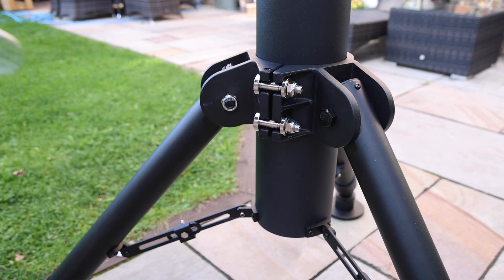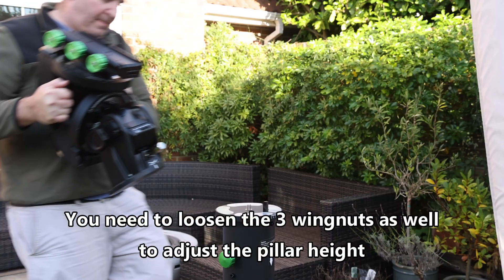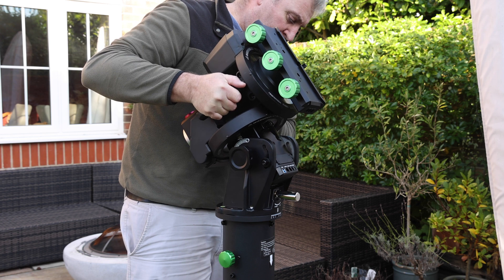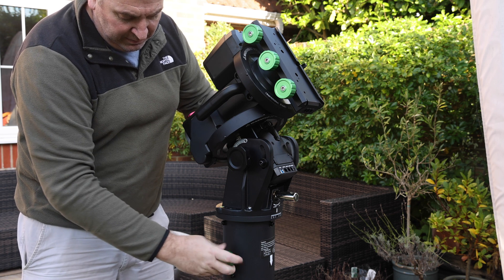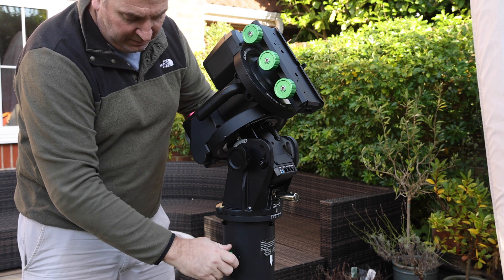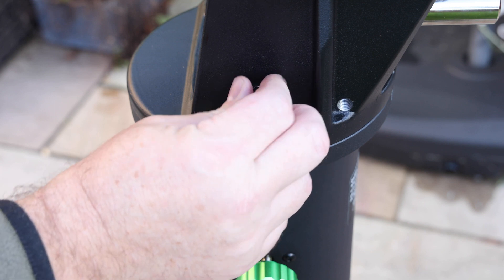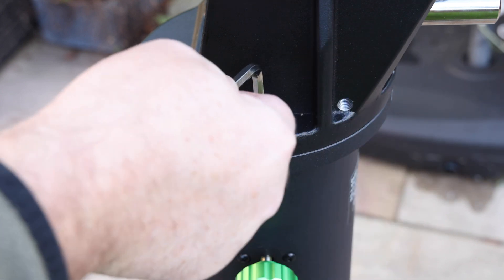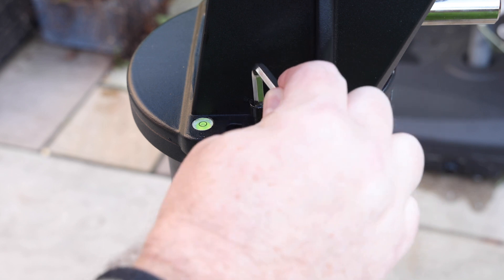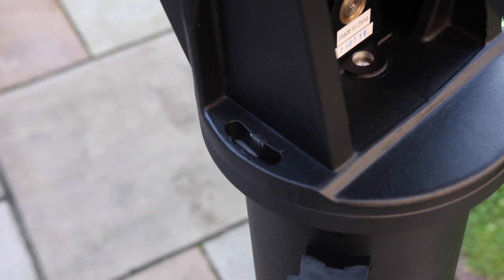These two nuts can be loosened with a ring spanner which comes with the mount, and then you can adjust the height of your pillar and lock it back off again. Now we're ready to put the mount head on the top. It's got a really nice gearing system inside the pillar — you just turn this handle here and it screws the central thread up into the mount. There are two additional securing bolts; these are a bit fiddly to put in. A ball-headed allen key is easier. It's really awkward because it's so close up against the body. Clearly if you're in an observatory this doesn't matter — you can just lock them down once you've got everything in position and polar aligned.